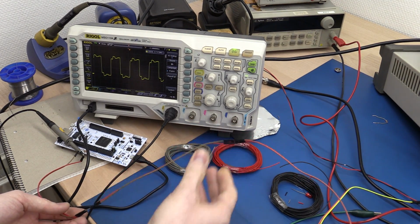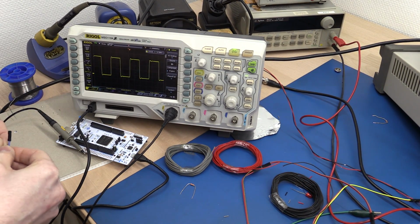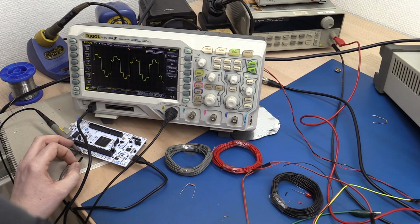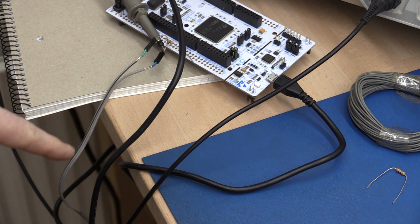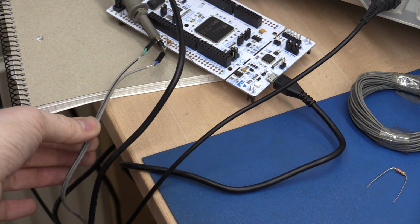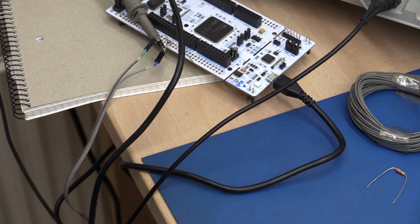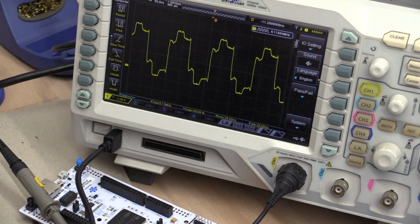because that will be a problem later. This wire is a bit longer even, so we will see longer time between the reflections. So this is just a normal 2-conductor wire, used for many things like speakers or power cords or whatever. You can see just by hooking up this wire with nothing at the other end, we get this really bad looking waveform here from the reflections.